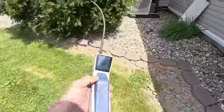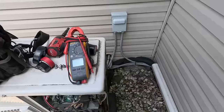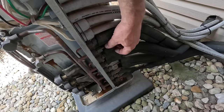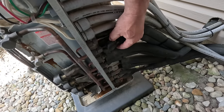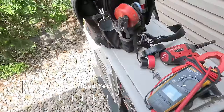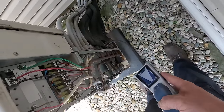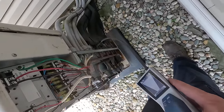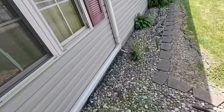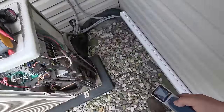Here's the unit. I've got her open, got my leak detector ready to go. Most of the time it's because people don't do the flares right and don't use proper flaring techniques. It's got all the metering devices back here — never out here, always on the inside somewhere: behind the wall, in the attic, in the crawl space. So we've got one going across here, going up. This one is running because the metering device is out here.